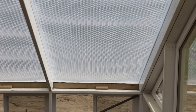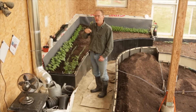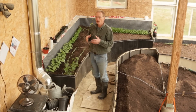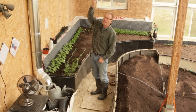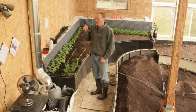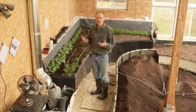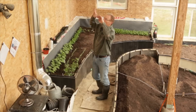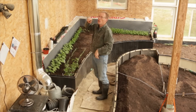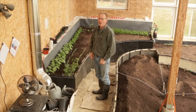Higher up, the white ceiling and walls use a liquid rubber product — that's the actual name of it. It's a paint-on waterproofing product that takes any shape you paint it onto, making it easier to work with around things like these skylights. We painted on three coats to make sure it was well covered, and it comes in any color — we chose white to keep the space as bright as possible. It allowed us to paint that membrane into each one of those skylight openings. There are seven skylight openings there, and getting some sort of membrane to wrap around all those surfaces would have been challenging.